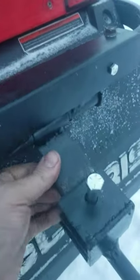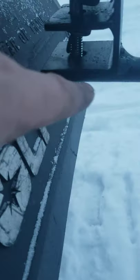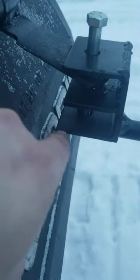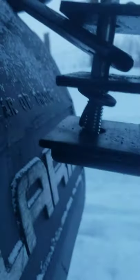I used some two-inch wide flat bar to run down — and here's the weird part of my hinge. I'm an idiot and I used a piece of two-inch C-channel flat bar to complete the hinge, which was originally going to be here. I drilled both my holes and then welded the bar right through where my hole goes, so I had to adapt — I added another piece of flat bar on there and welded it over. Now I've got a more in-depth hinge than what I really need.